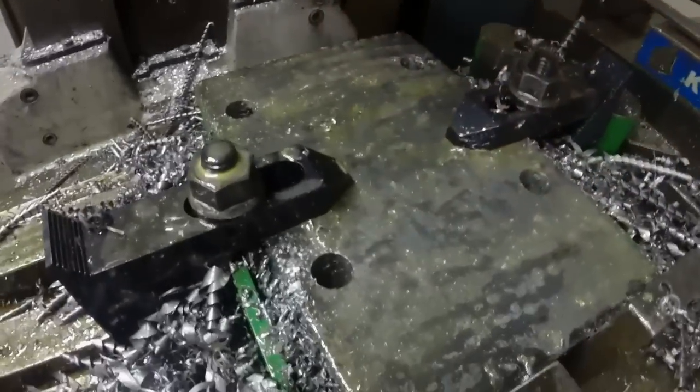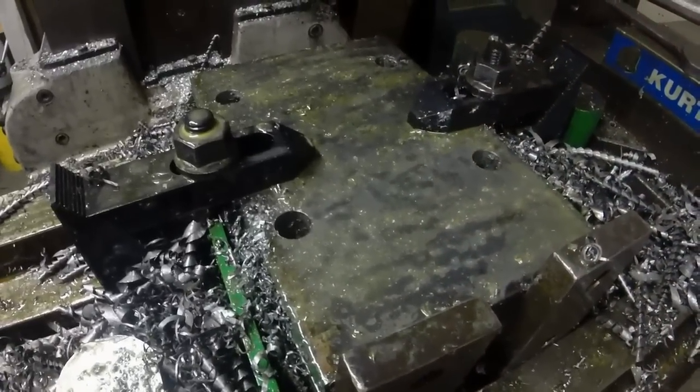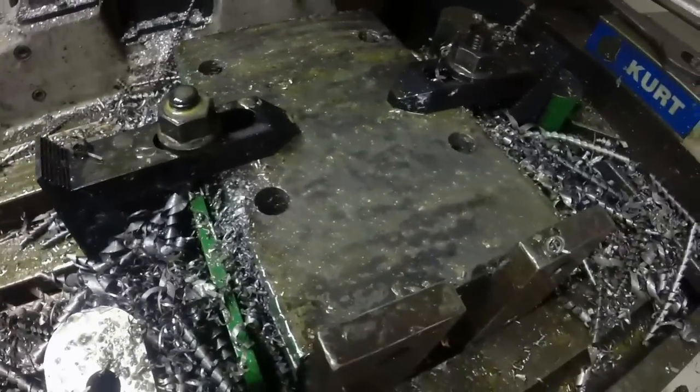So there we are. We've got four equally spaced, square-with-this-face holes that will all line up through all these plates, because they were all drilled at the same time - and that's what we're looking for. So when we go to put it together it will actually go. I hope this trick will be useful to you all, and thanks for watching.